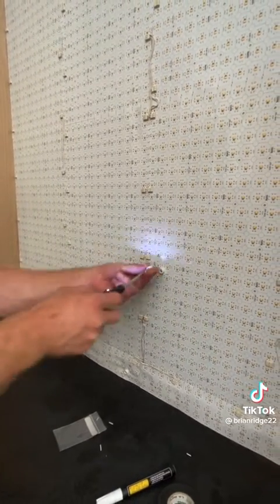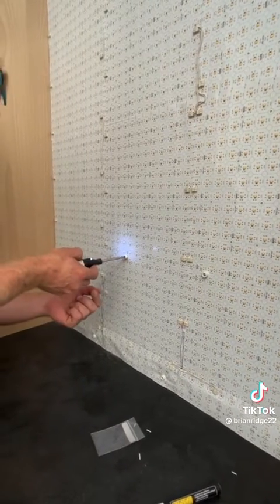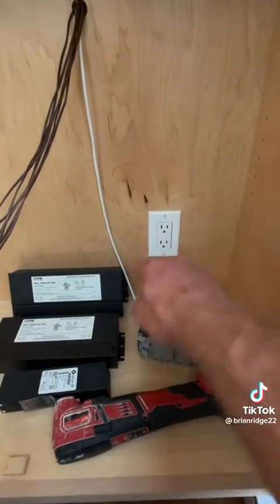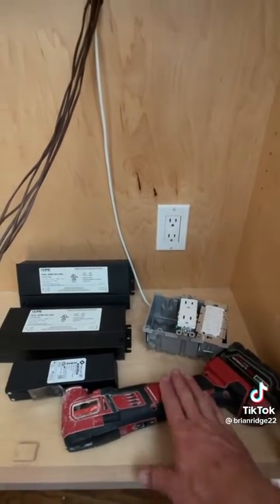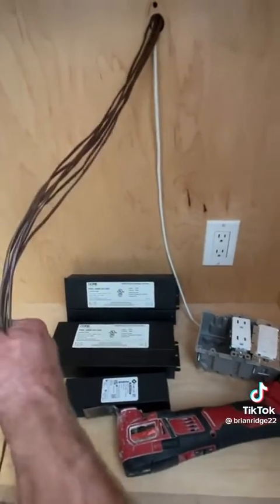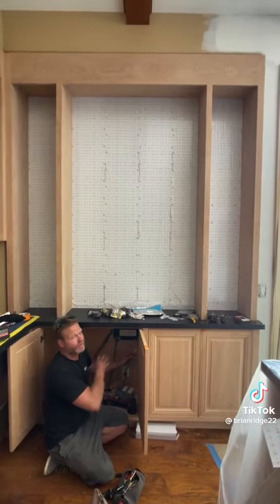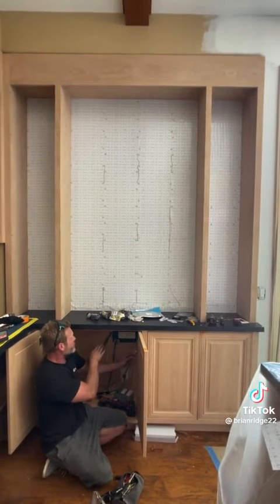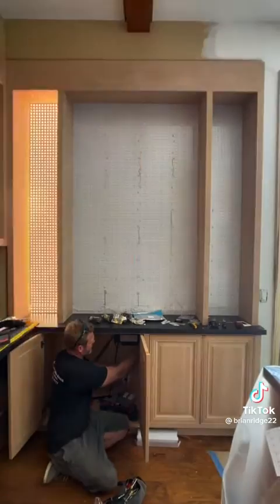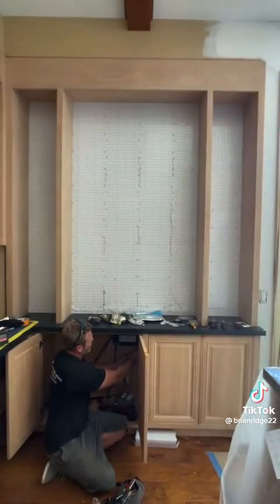Installing the spacers — one there and then one there. Now I'm going to cut out my three-gang box into the wood with my multi-tool so that I can have three switched outlets for my drivers, and then I'll land my home runs to the drivers. I always like to test each home run before I get too deep, so I installed the appliance cord on the driver, plugged it in temporarily, and now I'm going to test each home run to make sure I don't have any shorts.